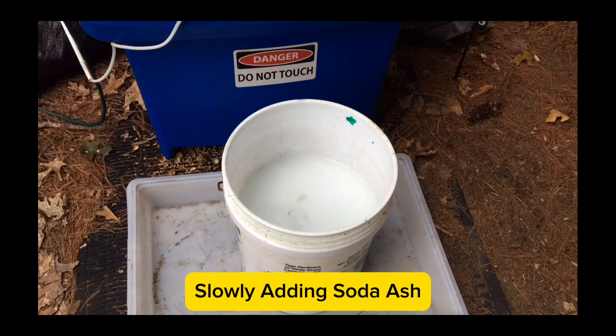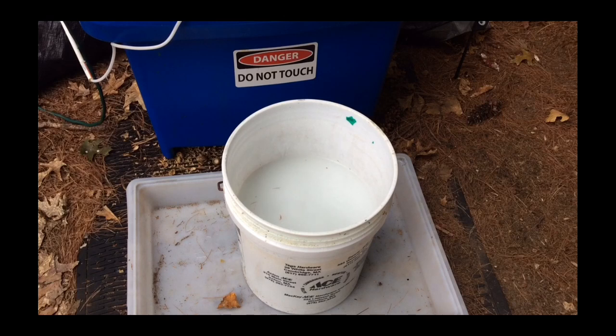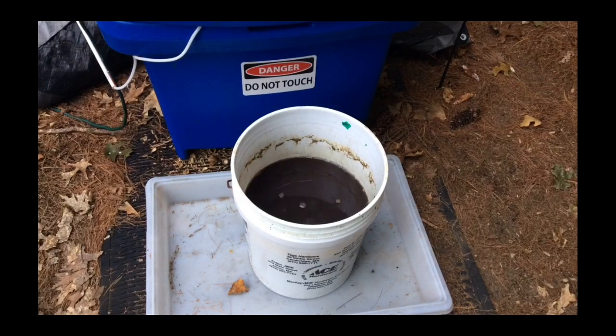I will neutralize the pH from 0 to 7 in several small steps. Once the fizz settles down, I stir it, wait a few moments, and do it again. The pH change is almost sudden — it goes from 0 or 1 right to 6, with no intermediate steps of 4 or 5. It's probably not a bad idea to treat the iron that went into solution, and you can look that up online, but there's very little iron in this solution so I've skipped that step.